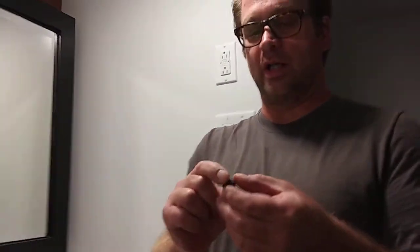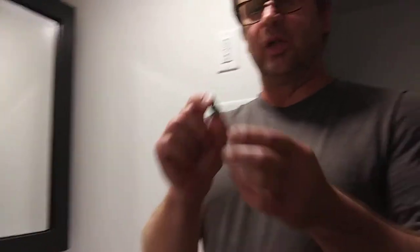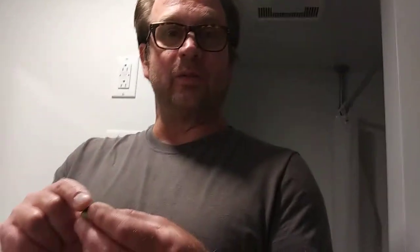We got it from Conservation Warehouse, which I ordered on Amazon. None of these were available locally because this Delta faucet uses a metric aerator, which is called a Tom Thumb aerator, and they're actually very hard to find in any local box or plumbing stores.